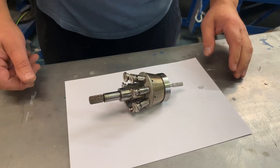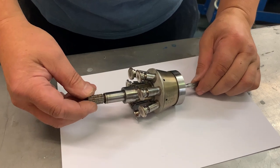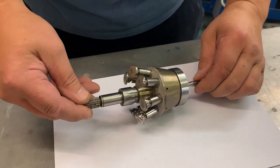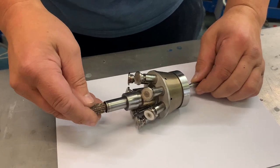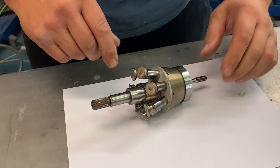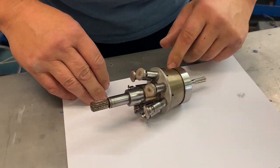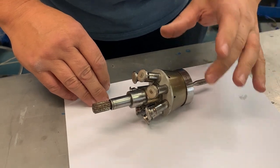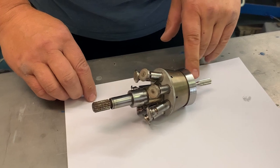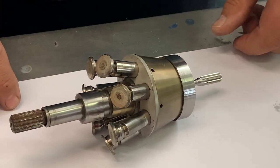This is the rotor from the B-size pump — the part driven by the engine accessory gearbox. There's the spline drive. The shaft runs in carbon bearings, very close tolerance, because kerosene is a terrible lubricant. It all has to be lubricated with kerosene. The back runs in a bearing band, which also runs in a carbon bearing — again very close tolerance, so it doesn't heat the bearing and melt it. That's the drive for the hydromechanical governor I mentioned before.